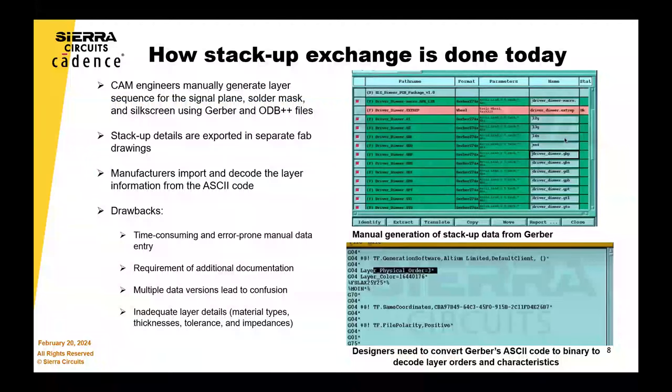I'm going to go through it so people can see what's going on. Whenever we get Gerber, we do have to import that into — in our case, we're using the Frontline Genesis system where we run all of our DFMs. We have to go through the input module for that tool, and the input module is absolutely guessing as to what file is what. So we have to manually make sure that everything looks right. And there can be some file format issues and all of that.